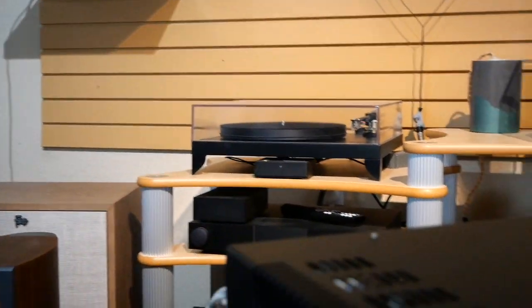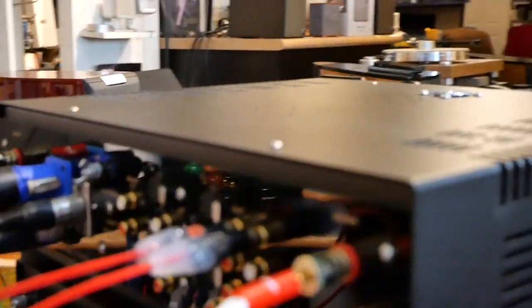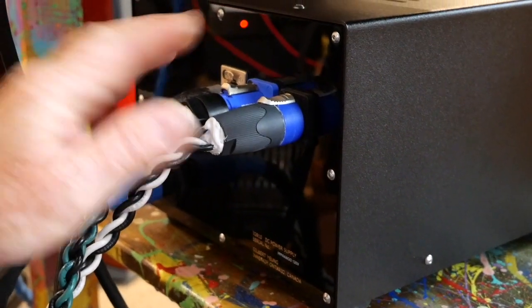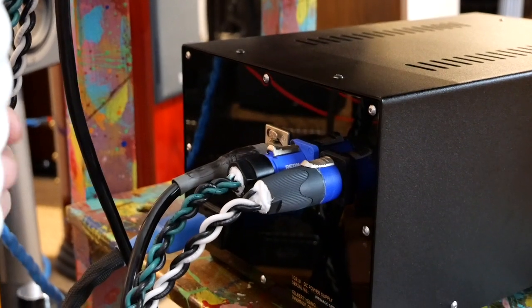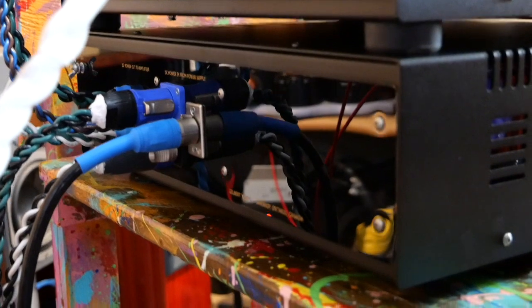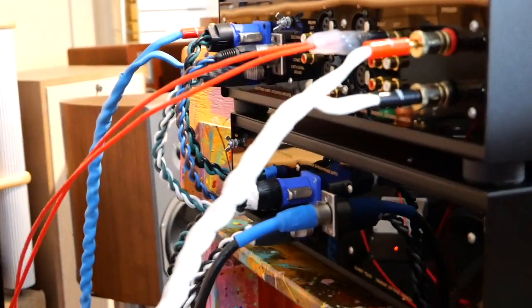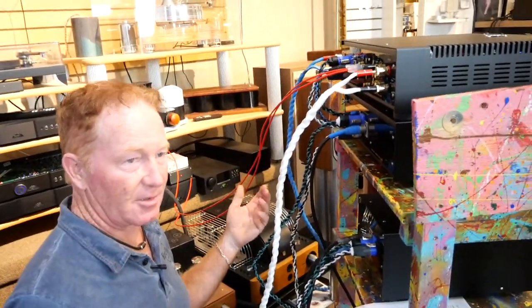On the back of this, the amplifier has the power supply, as we mentioned before. You see these three cable connectors? One of them is for the tube filament, one for the signal line, and one for the power amplifier output — so transformer and output, signal path, tube heater or filament. The filament is the thing that lights up and glows in the tubes. When you have 150% more — which is what we did here, we added 150% more than we had originally — we create very, very stable heat inside the tube. Without that, if you have unstable temperature inside a tube, it doesn't function as well: it's not as fast, not as beautiful to listen to, and there's more distortion. This way it's much, much quicker.